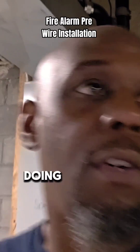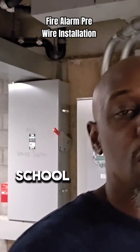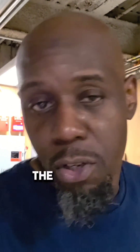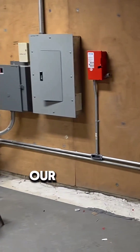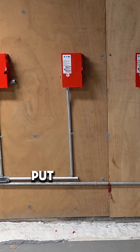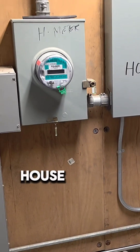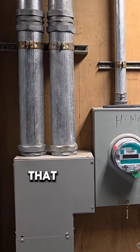Today we're doing an upgrade on a fire alarm system in a school. In the basement they're adding new classrooms, so we have to put in new fire alarm devices — some new COs, some new horn strobes. Here we have our fuse disconnect switches. We're going to have three booster panels, and it's coming off the house main here — tapping off the main power.